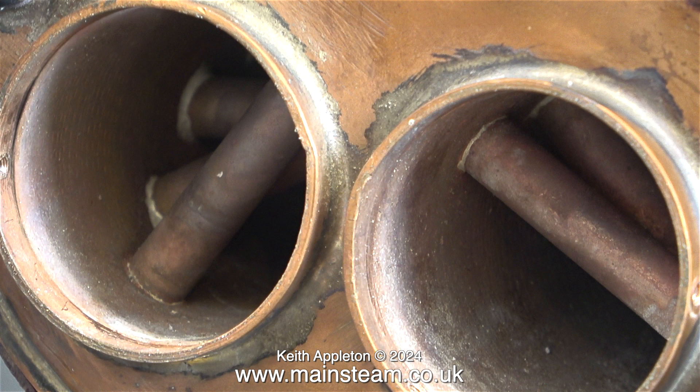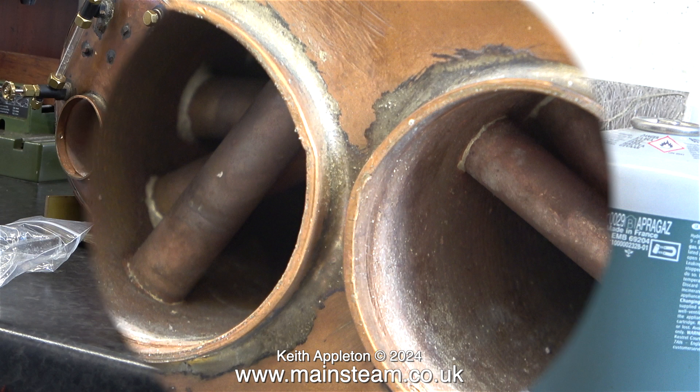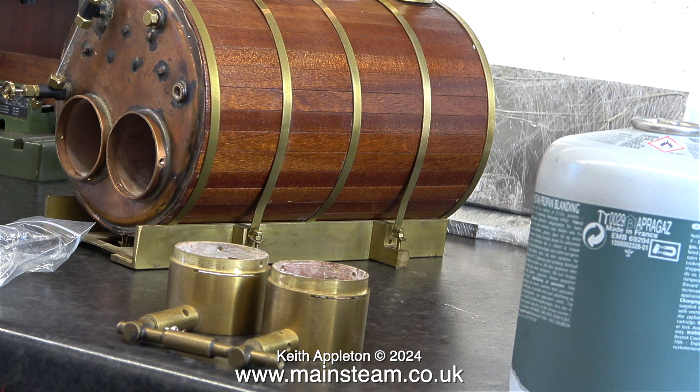This is a good thing for two reasons. Obviously the heat exchange is good because there are more tubes and the way they're arranged is much better in many ways. And because of the radiating tubes, I think that's why the gas doesn't explode. It does pop when you light it — you would expect that — but it doesn't go bang and blow one of the burners out of the flue. I think the volume of the radiated tubes means there's less air in the tubes to mix with the gas and make it explode.